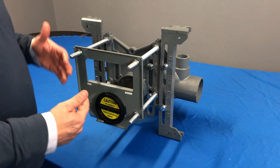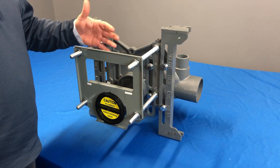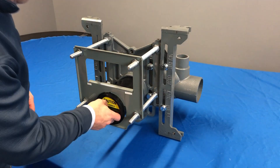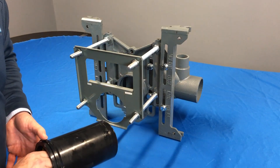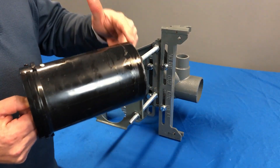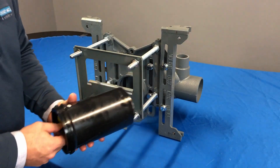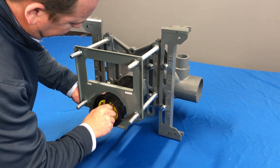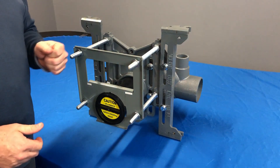Now I know what you're thinking — in a true job these walls can adjust back and forth. Say they remove tile: all of a sudden our wall plate is sticking out too far. It's very simple. From the front, we're able to do a quarter turn, pull the nipple directly out, adjust our face plate to the new finished wall, cut off a little bit of the nipple, add a little more petroleum lubricant, stick it back into the body of the carrier, quarter turn, and we're back ready to go again with a 30-pound test.